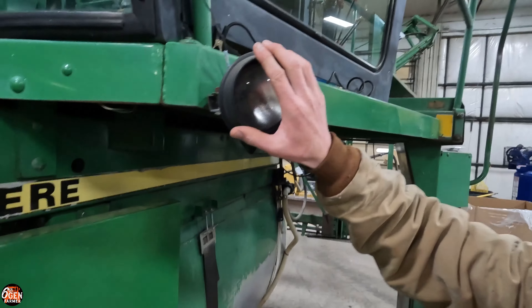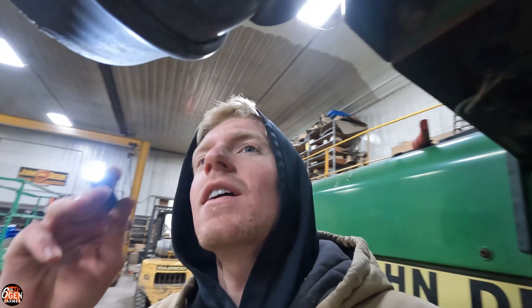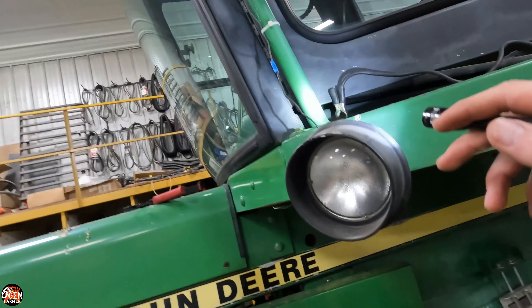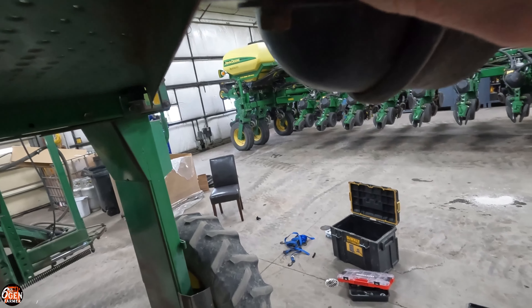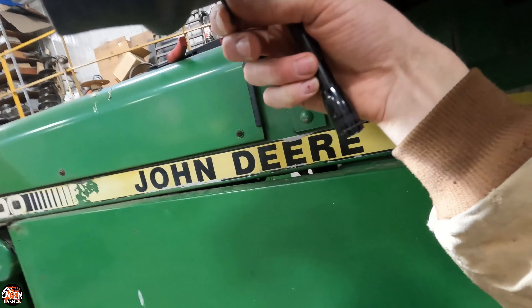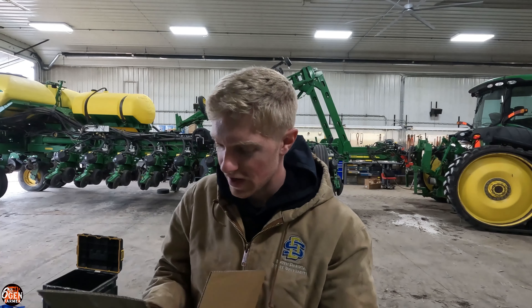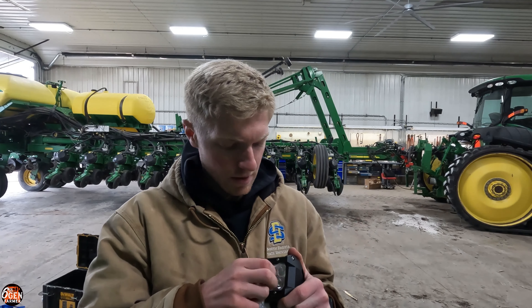First things first, I'm going to remove these lights down here - they're just going to be a hindrance to the corn. I'll remove these and put some LEDs up on top of the cab. What in the heck? Did they have a reverse ground light? I think they wired this light wrong - they took the power from the light up there and wired it directly to the ground on this one. For the new lights, I went to Amazon and bought the cheapest LED lights I possibly could - they're from the Nylite brand, not sponsored. I've put them on a bunch of different things and they've held up good, so why not my highboy?